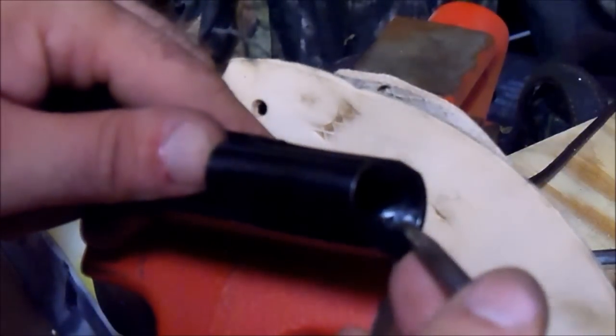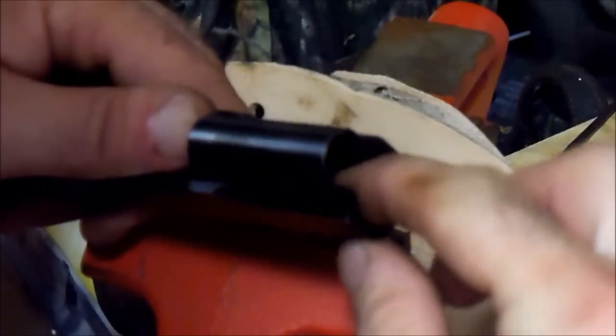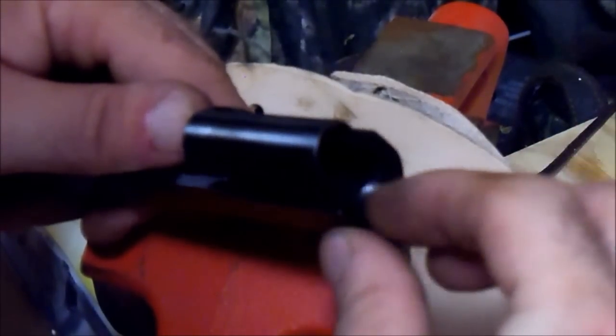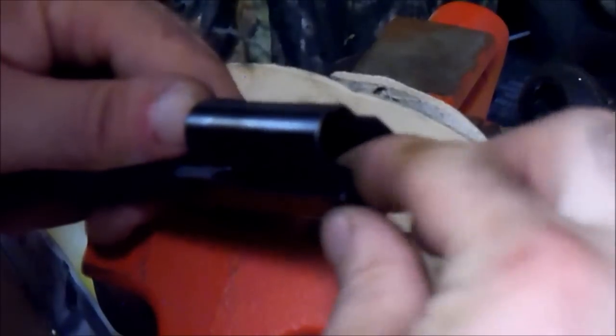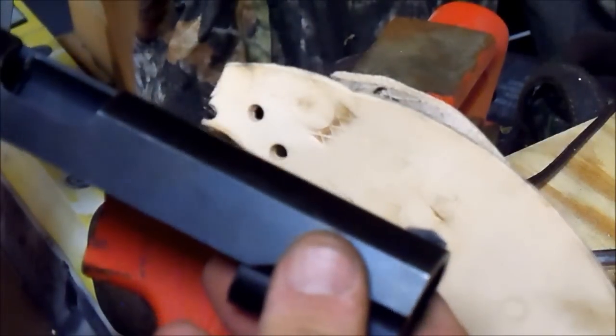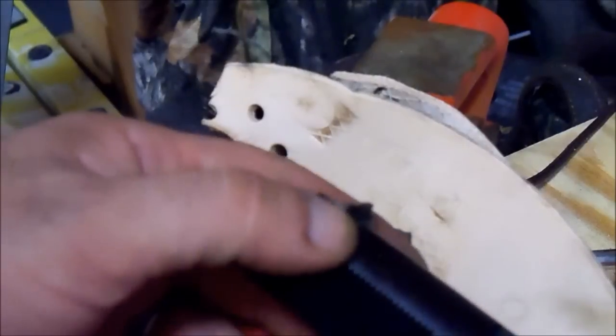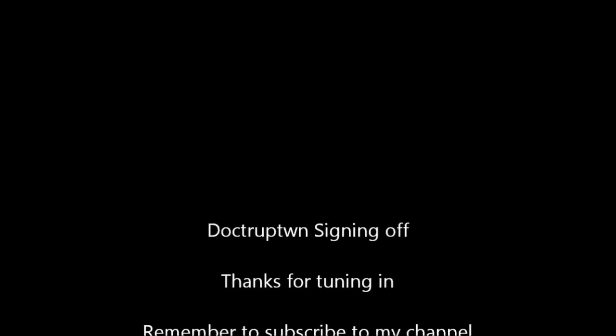Well, we've got a good peen. You can see where the tenon is flattened out right there, and that's what we want. What we'll do with our Dremel, once we get back inside, is go ahead and smooth that out. Because that does have to be absolutely smooth for our bushing to fit in there properly. You can see that we've got that sight installed, and we've got the rear installed as well. We'll just have to touch that up with some cold blue.